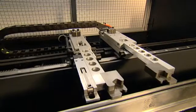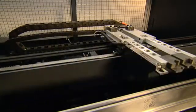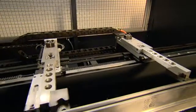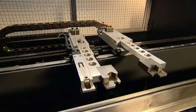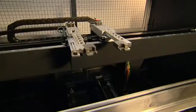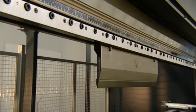The standard version of the e-brake is equipped with a CNC-controlled X-axis. Control of the R-axis, Z1, Z2 axes and a delta X-axis are optional. The complete 6-axis back gauge is available for heavier e-brake models with press capacities of 150 tons and 200 tons.